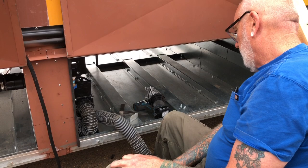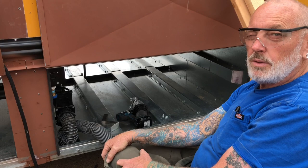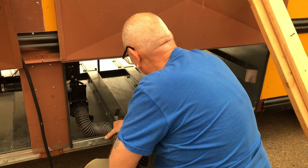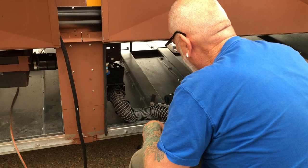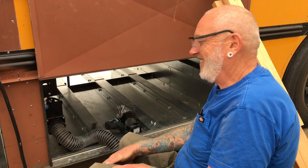It's not super ideal, but there's nothing wrong with it. Then we would just have a plug that we put in the hole with a couple of nuts or something to hold it down. I can't bring it out through there because there's an I-beam there. But if I go this way I could come out right here — yeah, that's easy, that's a clear hole. This could just turn and go down through the hole. And since we're only dumping gray water, I don't think we're really going to have a chunky plug situation, so I think that would be okay.